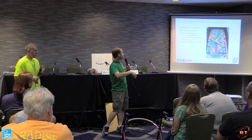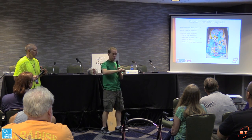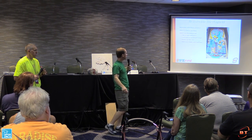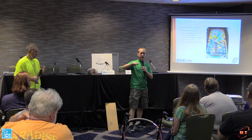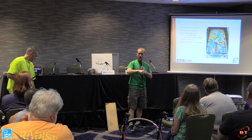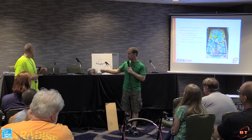I like to start basically from the bottom up, in that I'll put my posts in. I'll do all the playfield lamps, all the GI. Like I said, everything needs to come out, so put all new lamps in. They're inexpensive. And I'll just start building up to all the layered plastics. And then generally, with the way most games are, the ramps set on top of all of it, and the bigger toys. That's the last thing to do.